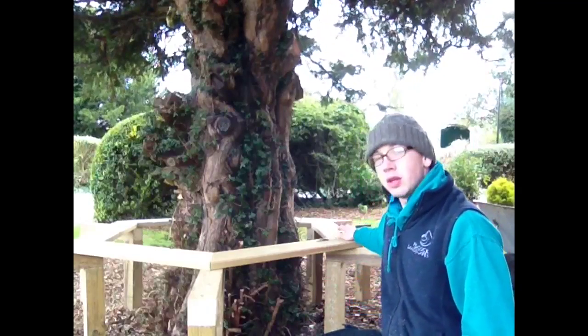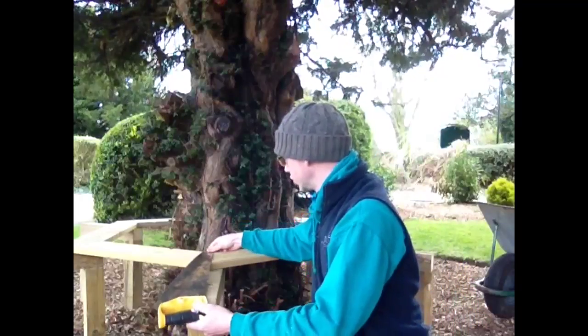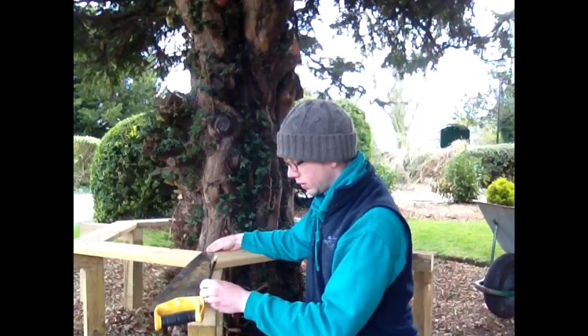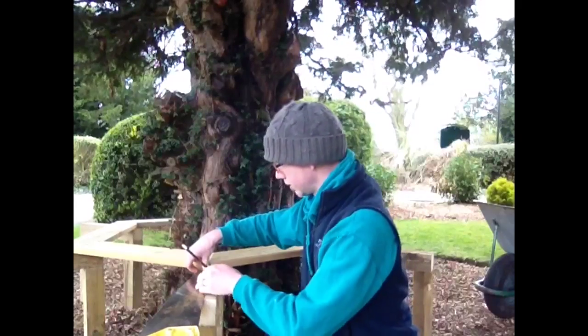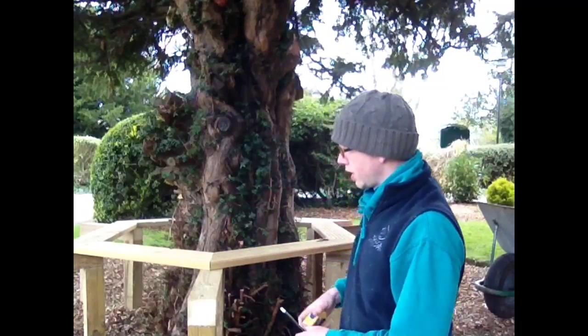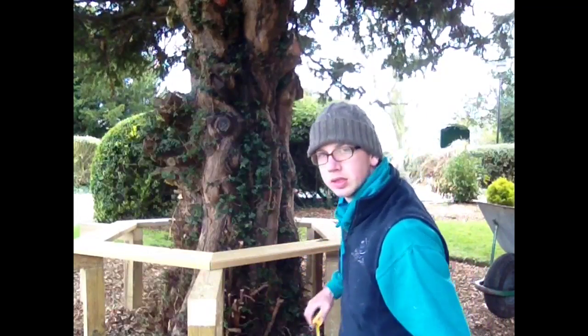And so, the way to do that, the most accurate line, I use my saw. I want to get the same linear line coming down here. So I mark it off here, bring it to the center here, and draw my line. Once I've done that, do it on each one, and then as you go around, measure the inside between the two, take your measurement, and then cut that at the same 30 degree angles on your chop saw.